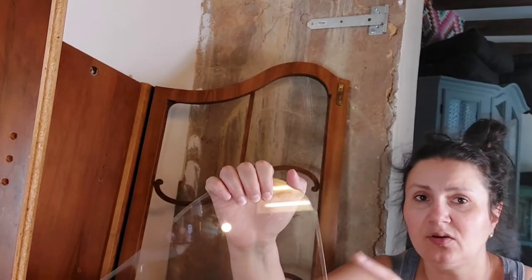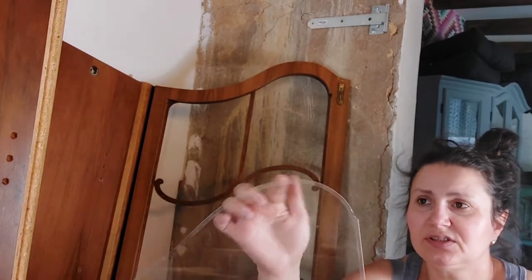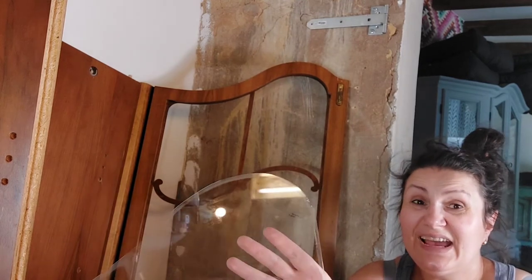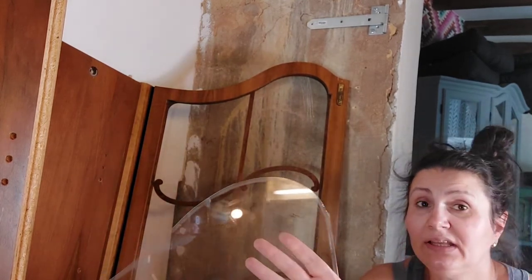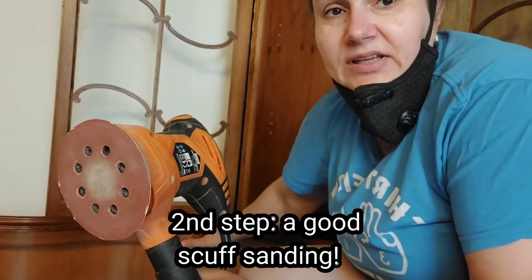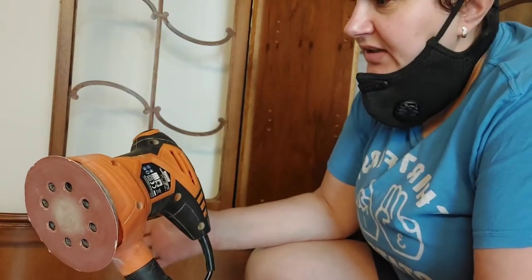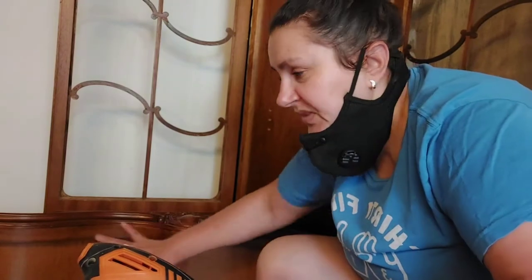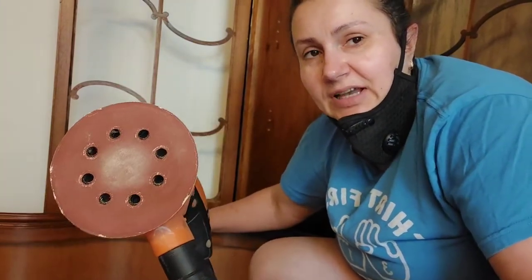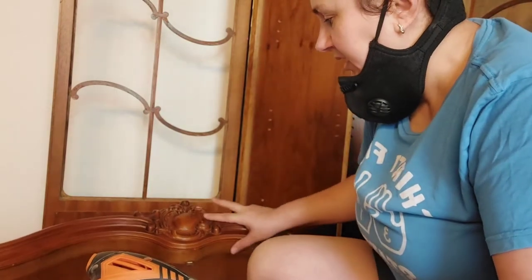Our first glass is off, but guys - a note: when working with glass with such sharp edges, it's better to wear protective gloves. Unfortunately I forgot to wear mine, but this is a reminder for me too - next time wear gloves, you don't want to cut yourself. I want to take advantage of the fact that this piece is apart, as some parts like the top are much easier to scuff sand and prime once taken apart. I'll use my sander as much as I can and then switch to sanding by hand for areas with all the moldings.